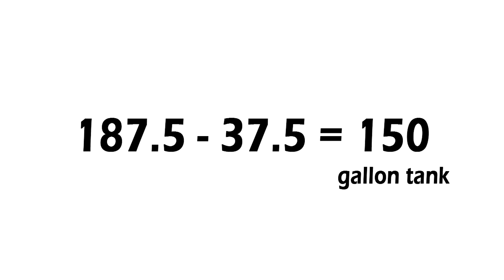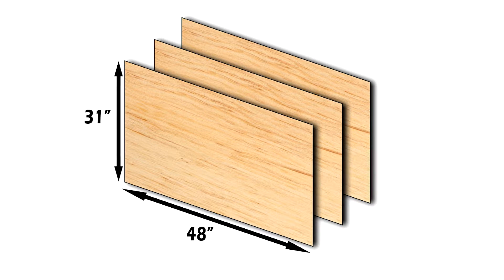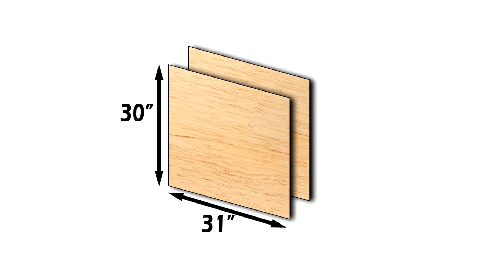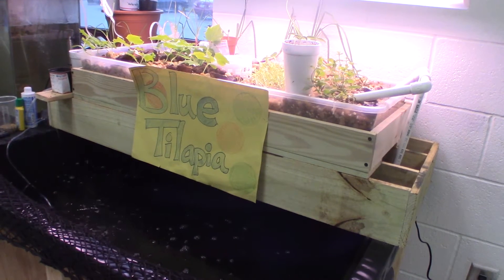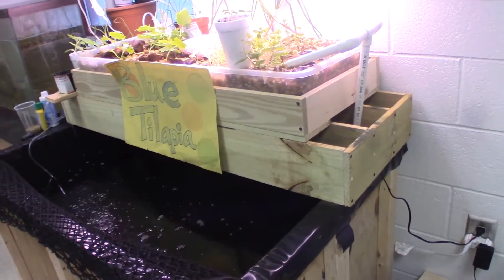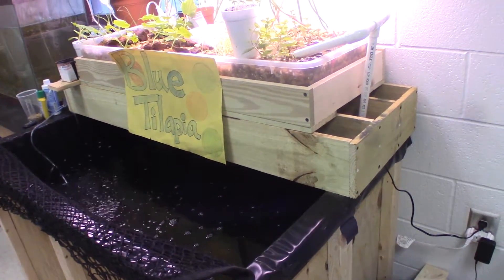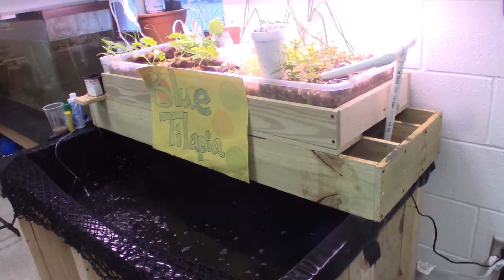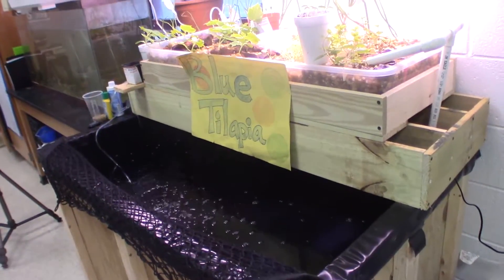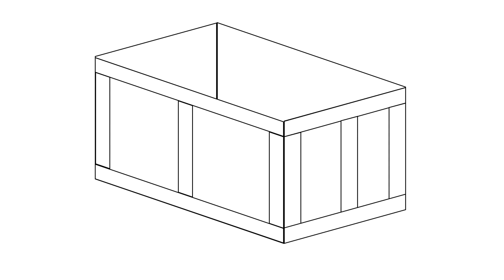The tank is made of three 48 inch by 31 inch plywood panels making up the bottom, front, and back, and two 30 inch by 31 inch plywood panels for the sides, giving us inside dimensions of 30 by 30 by 48 inches. After getting all the panels assembled with a combination of screws and wood glue, you need to make a frame to reinforce the walls and keep them from bowing out and busting open due to the weight and pressure of the water. For the frame, I basically made the box into a large shipping crate using 2x3 wood beams.